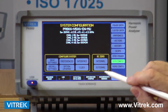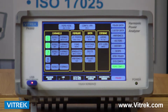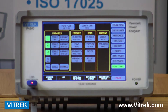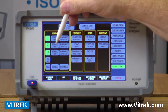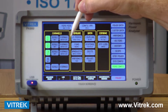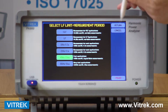I can set my clock and I can also do some zeroing out of my test leads if I need to. The next button I'm going to talk about is the actual channel setup. As you can see, listed are the channels that are installed in the back of the unit, and simply by toggling I can turn the channels on and off. I can scale the channels and I can also auto-range them. There are also different filtering techniques that I can use to filter my data.